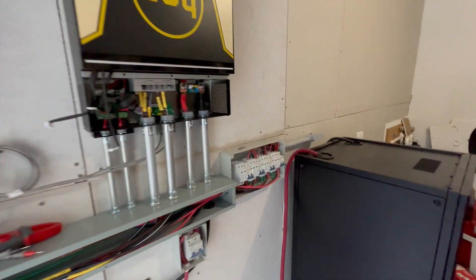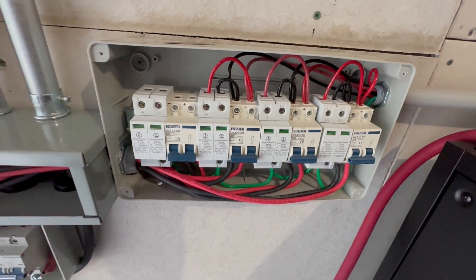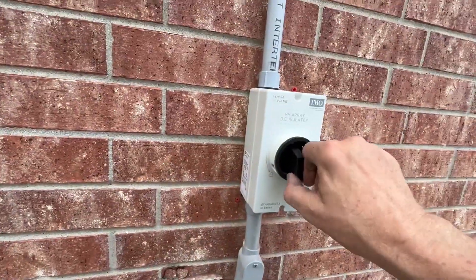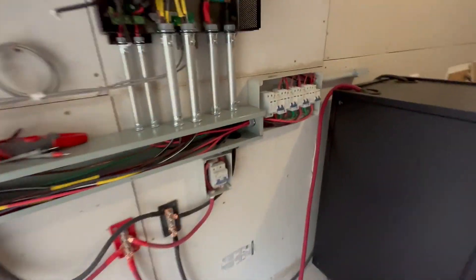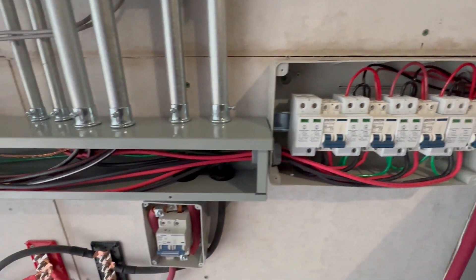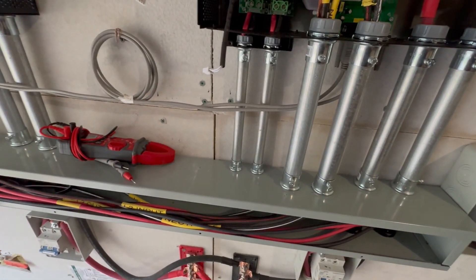Once I get these going, I'll be using the solar and battery. Here are the solar inputs — there's no combiner box; this is going straight into these right here. Outside, I have three strings coming into this PV isolator switch, which is in the off position right now. I went ahead and hooked up the wire for a fourth string as well, just down the road if I add another input. These are also wired into some SPDs. I used one-inch and half-inch conduit for these runs.